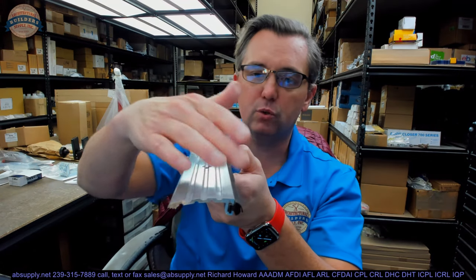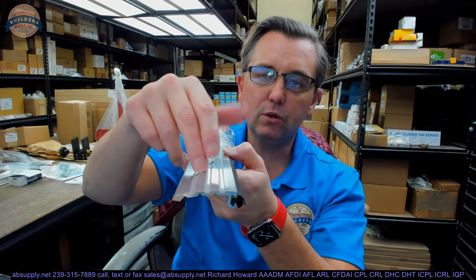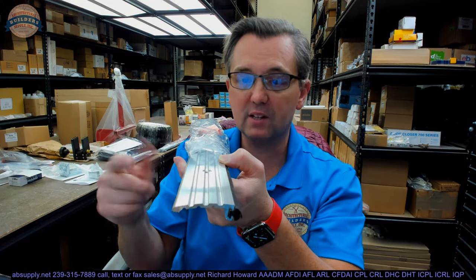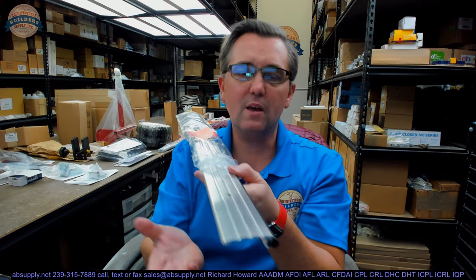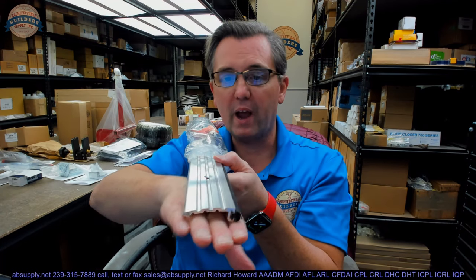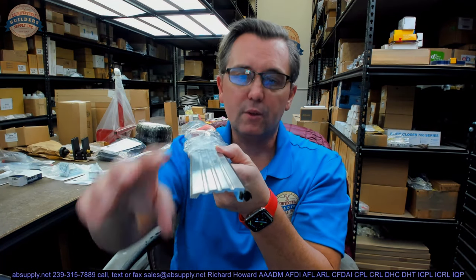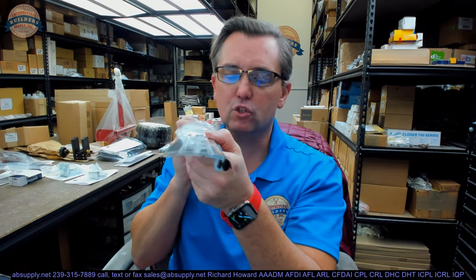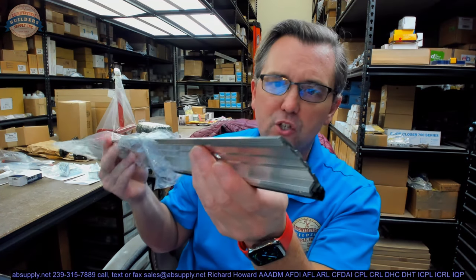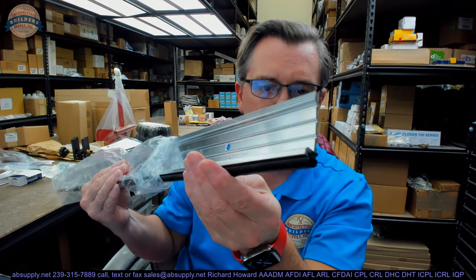This is really a stop as well, in addition to it being a gasket. You could use this in applications where you require the combination of a gasket and a stop. I don't know that you'd really ever see this installed as a stop strip on top of an existing threshold. It's a bit wide for that, plus it has this profile. Those are generally a little bit smaller and just have a more or less rectangular shape to them. So you could use it in really either of those applications, but I think the former would be more typical.